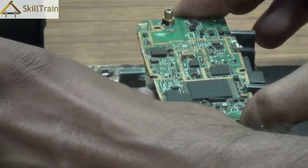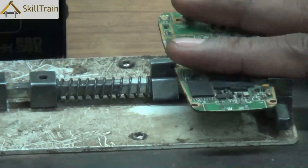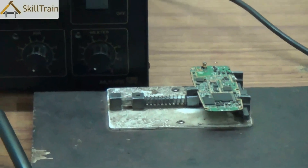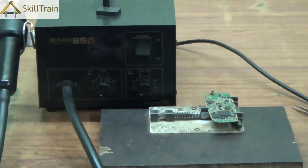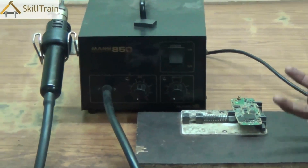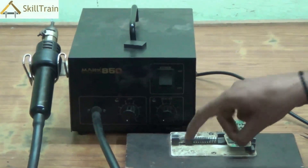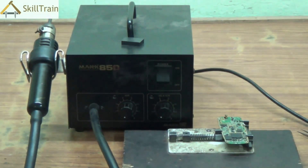Once the PCB is tightly held in its position, as you can see on the screen, it is very easy to work on. Components will not move due to misalignment or movement of the PCB, so there are no chances of misalignment. Additionally, when you hold the PCB in your hand it can hurt your hand if you are using the hot air gun at that time. Hence it's important to always place the PCB on a PCB stand while working with an SMD, ensuring your hands are not hurt or burnt.